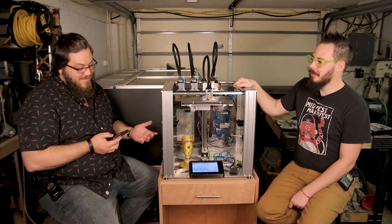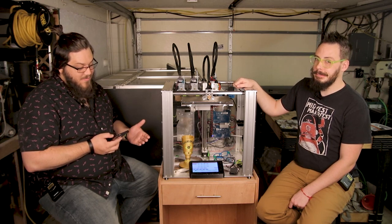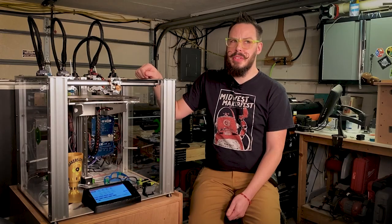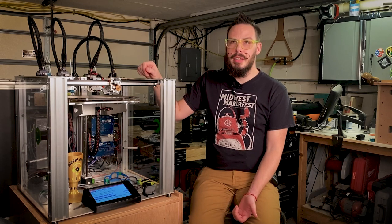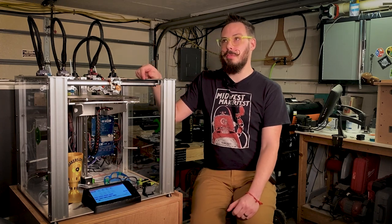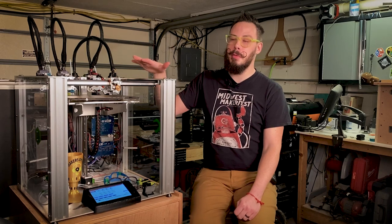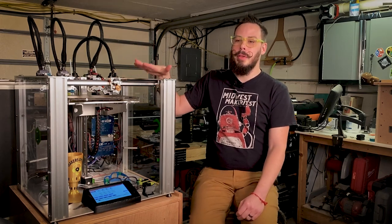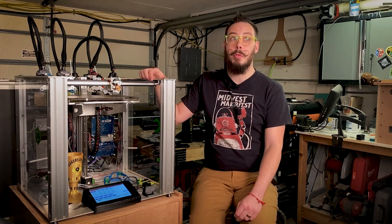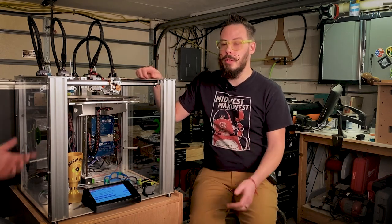Voltages, as I understand it, it's necessary to select a motion control voltage, a hot end voltage, and a heater bed voltage. So 24 volts all the way forever until we can get more volts, more better. But the downfall of that is if you're using a Simplo, you really should probably go down to a 12 volt power supply for the ESC. And you need to run a common ground. You should probably take basic electronics if you're going to do that and you have questions. I didn't know until I read it.